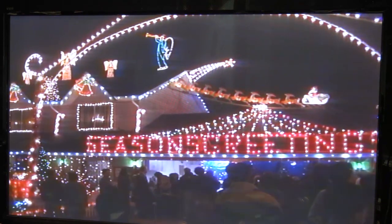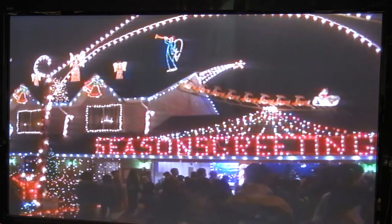See, what's happening is the binder here is actually starting to adhere. The binder that holds the tape coating onto the base is actually oozing through the tape. And when you see the picture break up like that, start to tear, that's the tape actually sticking to the drum.